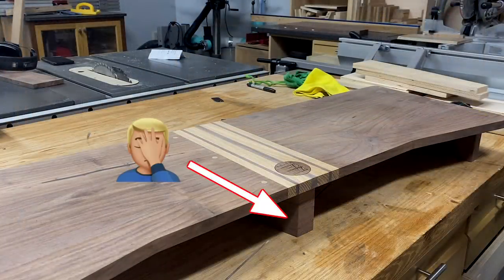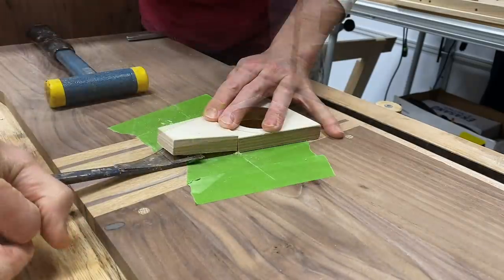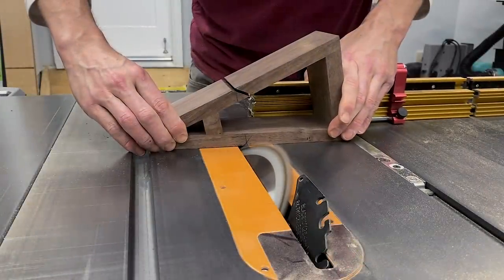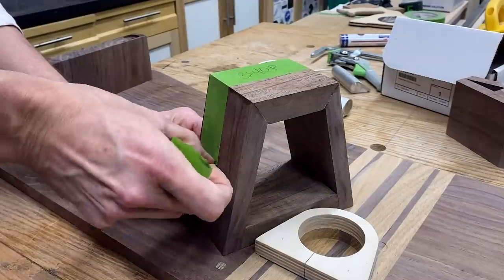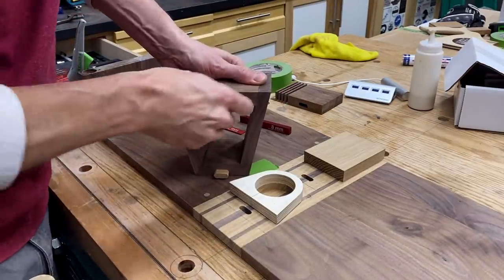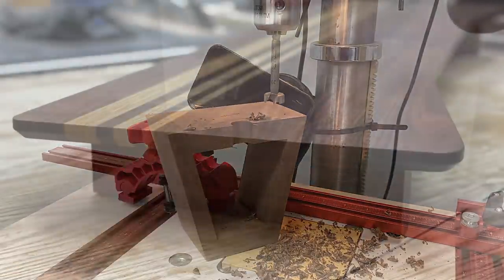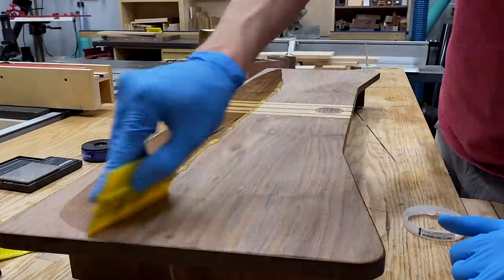One of the functions of this monitor stand is to allow me to slide both keyboards underneath so that when I'm not using them, they won't be subjected to kitty paws walking all over them — yeah, I'm looking right at both of you, rascals. And now I had to modify that center support section yet again. Cut that off, glued on another piece, and then plunged for some dominoes to finally get this thing actually attached and bang it home. I added a little access hole for the wire so this thing could sit flush on the desktop. And here's a picture of another version I made with no center section, just completely long grain the whole way — turned out much better. But anyway, back to this one.